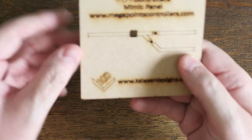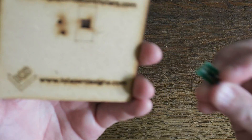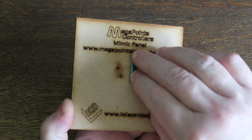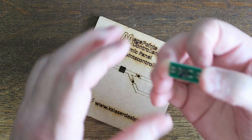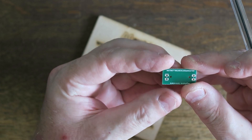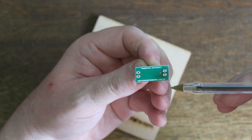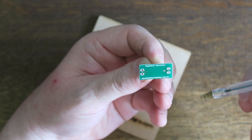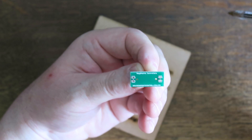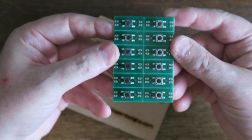Starting with the button on the right side, you can see we've drawn a road on it to match the design. We've made it rather easy — aim for the square hole we've prepared and two screws will secure it. But before we do that, let me talk about how it's wired. You'll notice there are four connectors on it and they go through both sides. The top two are connected together and the bottom two are connected together, so you can use either side. When you put lots of buttons in a panel you might want to link all of one side to make a common ground — I'll demonstrate that in a later video. When you unpack the buttons you'll see they're together in a biscuit form, and all you do is snap it with your fingers to reveal each button.